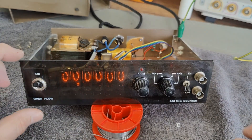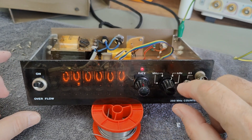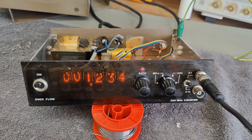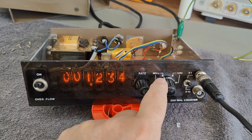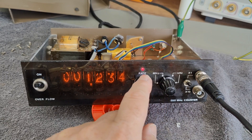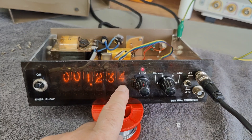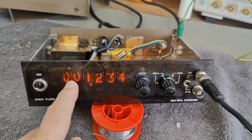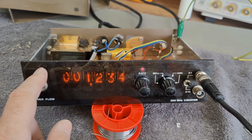So maybe there is something to do with this. I think I did figure this out — the problem is that it's trying to give you a lot of decimals. So in megahertz mode, it's at the moment gating one second. So that one will be one hertz — that's the resolution. So that means this is one kilohertz, 10 kilohertz, 100 kilohertz. So it can do almost one megahertz in this setting.